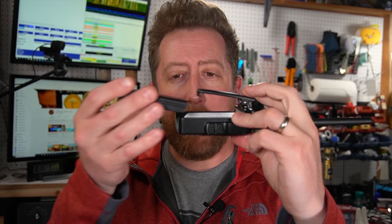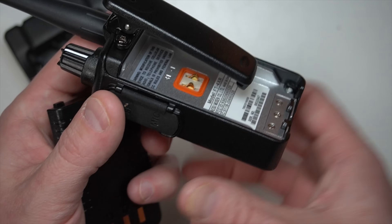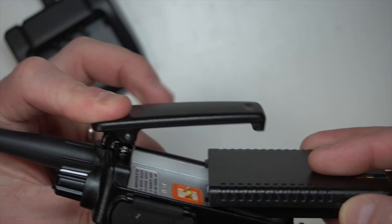Connection to the battery is handled by a drop-in, and there is a water-resistant seal on the outer side connectors to the battery. Regarding this radio as a radio — the ability to receive and talk — this is a 2-meter, 70-centimeter radio. A bit of a difference from the Baofeng: the Yaesu will automatically add an offset for you when you're on VHF or UHF for the repeaters you may be working. This supports PL tones for accessing the repeater on transmit and receive, and it can support DTMF tones if you're a repeater owner and want to key in control remotely.